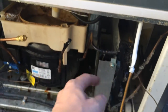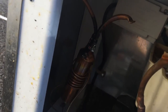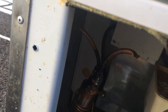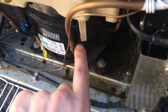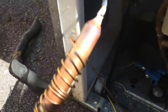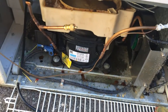So we've got to join that onto that — that's got to go in the dryer. Let's see if we've got a new one. Not much of a stub to join it onto then. Got the suction line done, just brazed the new dryer in. Clean the flux off of that and then leak check it all and give it a good vacuum.